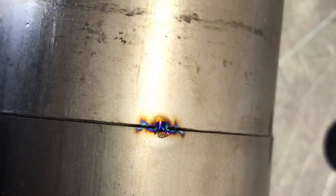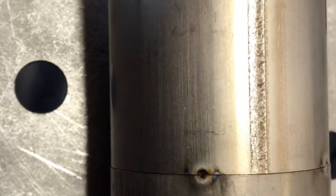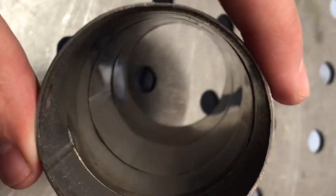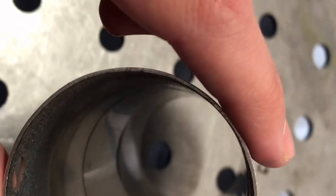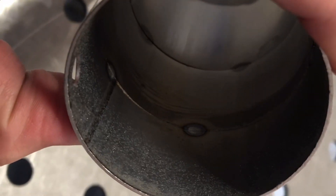I tacked it here. You can see some of my tacks — I did my best cleaning it, but you can probably still see some contamination there. On the outside of the weld pool you're still seeing some colors. For practice, I think this is going to work out really well. Note that I did tack this all without purge on the backside, so you can see some dull greenness there. It wasn't purging the backside for the tacks, but we'll see how it looks after I start welding because I'm going to purge it for welding.